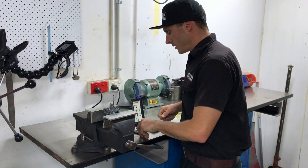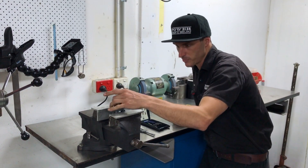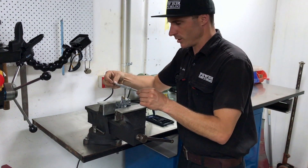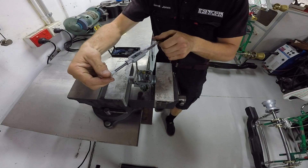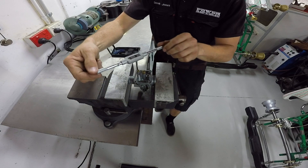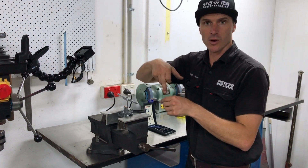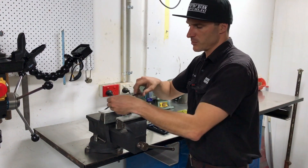You don't have a lot to deal with here. Check for square — you can use your eye, lining the tap up with the choke jet part of the assembly and just eyeball it. If you're a bit off when you're trying to tap, as you do the next turn just push it in the direction you want it to go. Try not to get it in at 45 degrees because being aluminium, you'll wreck the thread. Once it's started and square, do half a turn forwards and break the chips. This one being a shallow hole it's not as critical, but as holes get deeper you need to break the chips off otherwise the tap will get stuck, especially in harder materials — you'll start to break taps. Breaking chips in aluminium is just good practice.